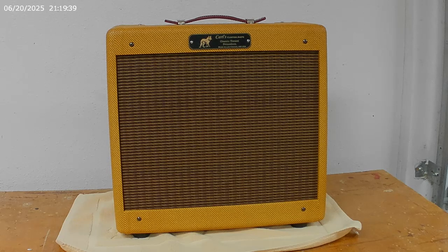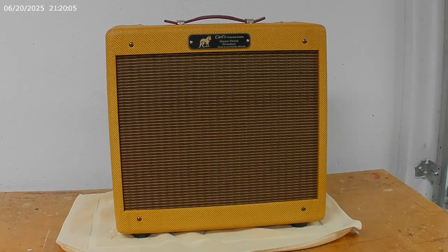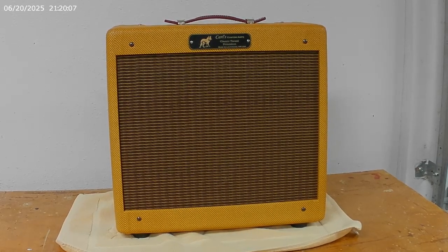Fortunately, they used light Alnico speakers, and so it really didn't affect the durability of the amps. But over the years I've seen amps come in where someone's replaced the speaker with something heavier, and over time it's damaged the baffle. In my estimation, anything between about a quarter of an inch and a half inch is still adequately thin that it resonates along with the speaker, and it could be considered a floating baffle.